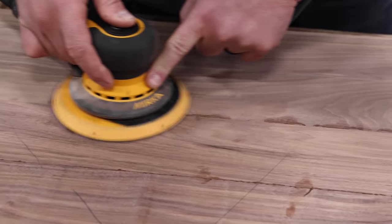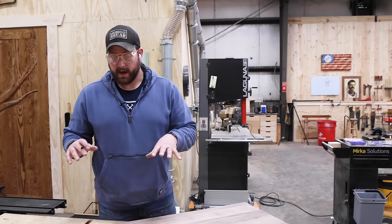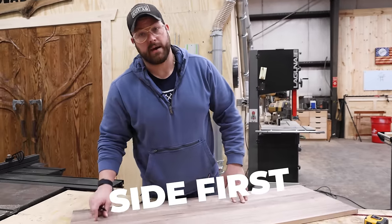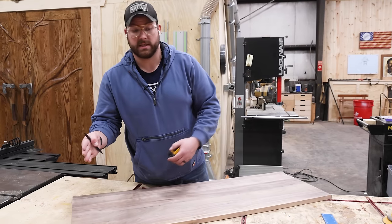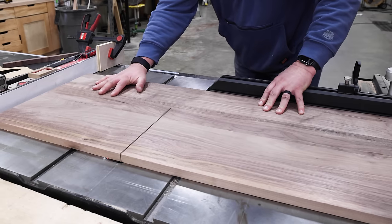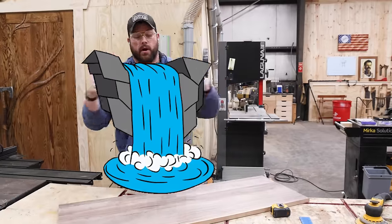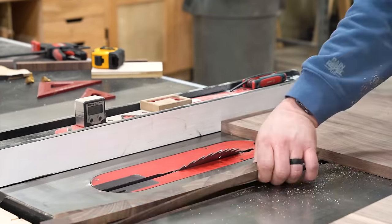What we're doing here is cutting the top, and I want it to look like a continuous waterfall on the top and both sides. To do that I have to cut the side first, then the top, then the side — parts are going to be six inches, 18 inches, six inches, 18. That'll allow me to wrap this in miters and it'll look like a waterfall all the way around, except for the bottom joint which you won't see. Cross-cut sled first for straight cuts, then miter.